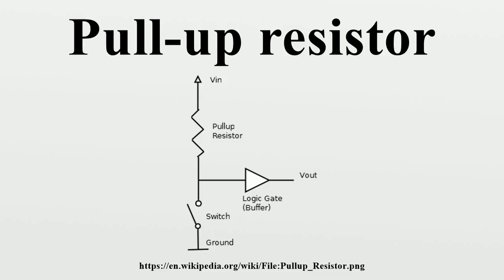When the other components associated with the signal are inactive, the voltage supplied by the pull-up prevails and brings the signal up to a logical high level. When another component on the line goes active, it overrides the pull-up resistor. The pull-up resistor ensures that the wire is at a defined logic level even if no active devices are connected to it. A pull-down resistor works in the same way but is connected to ground, holding the logic signal at a low logic level when no other active device is connected.